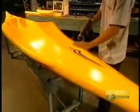While inspecting the kayak, they remove any plastic ridges left by the joint between the two halves of the mold. They now move to finishing. This begins with the screwing on of carrying handles. Here they cut the opening for the baggage compartment. And then they install the trimming.